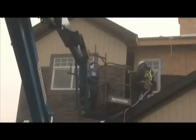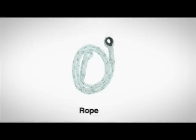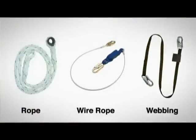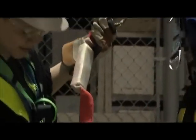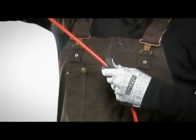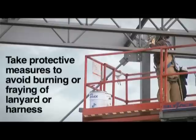Connectors are all the components between the harness and the anchoring point, including the lanyard. Lanyards are made from a variety of materials such as rope, nylon or polyester web, or steel cable depending on the work environment. Web lanyards are lightweight, easy to inspect, and long lasting. The wire rope lanyard is more appropriate for situations where there are welding or cutting activities which might cut, burn, or melt other types of lanyards.